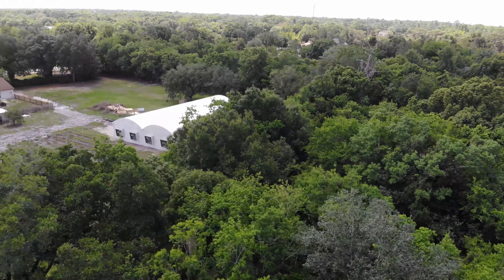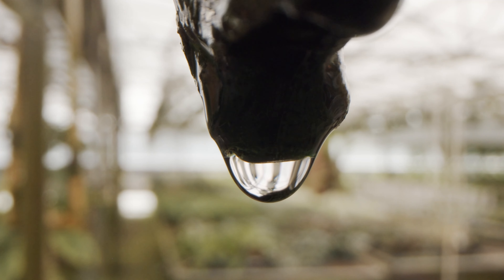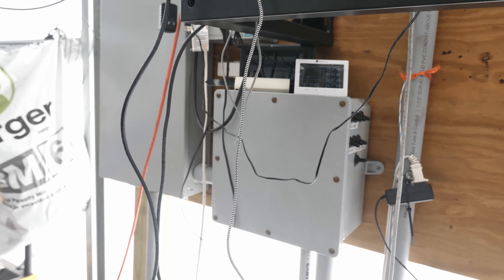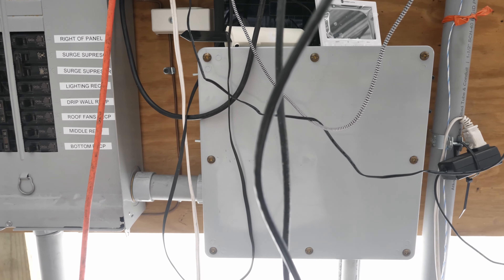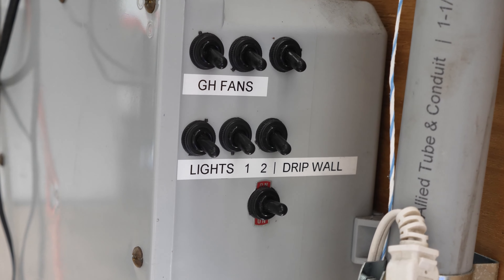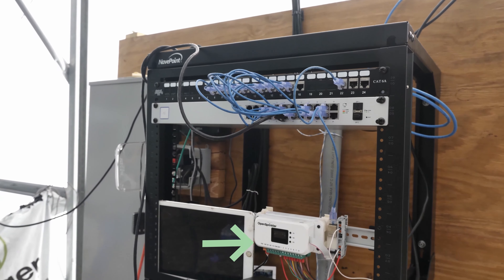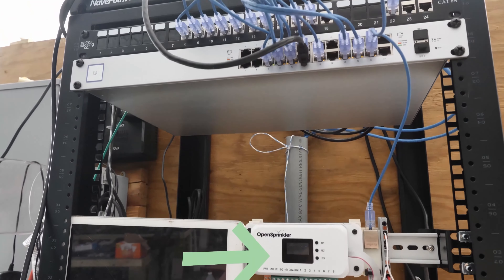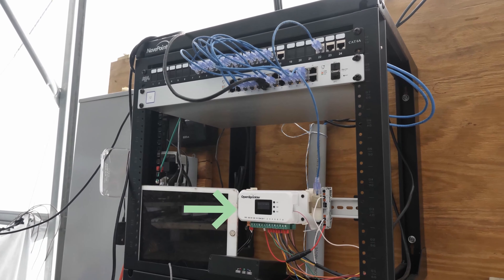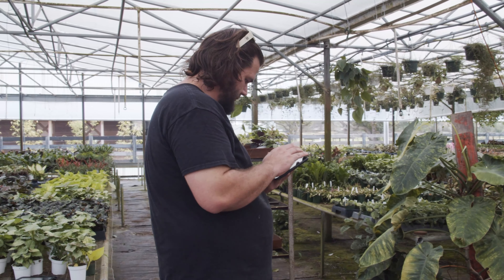In addition to the active cooling, there are several other smart features in this greenhouse that we wanted to incorporate since we were designing the electrical grids from the ground up. Every single circuit inside the greenhouse passes through a master relay junction box, and inside that box are a series of different controllers, relays, and contactors that allow us — whether remotely or by using manual switches on the project box — to control all of the irrigation. We have a controller that is able to turn specific bench irrigations on or off remotely or in person.